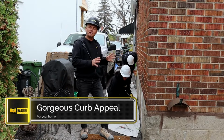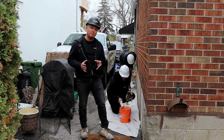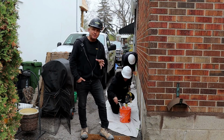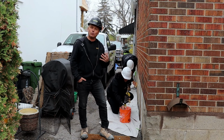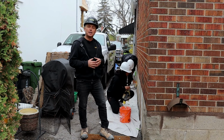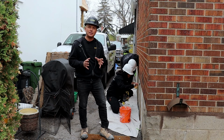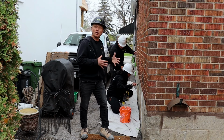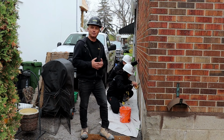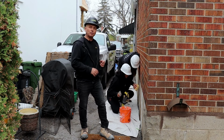Now on this side of the wall, we've already cleaned it. We're at the second stage, which is prepping the wall. We're using a cementitious type of fill. It's a little bit different than a typical mortar, which is a Portland base that holds water. This is fast drying. And we're just simply using it to fill all those holes and cracks in the masonry work where we may not be sure that the SurGuard is actually getting fully attached to the foundation. So we want a nice solid base on which to apply it, and that's what they're doing right now.